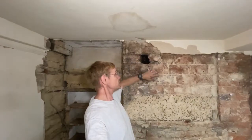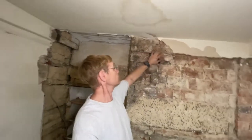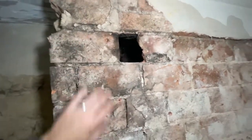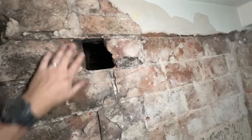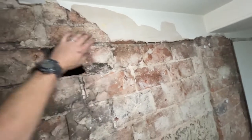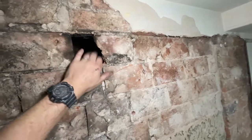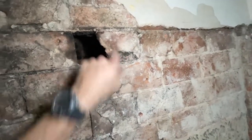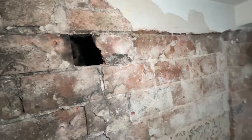I don't know whether you saw as I was taking this plaster off, but this area was black, so I've had to dig a bit further, and yes, we've got a hole in the chimney breast based on the soot marks. It's obviously some time since the fire's actually been used, so the picture rails had to come off, so we'll work out how to patch that. I'll cut the brick and slip an insert in.